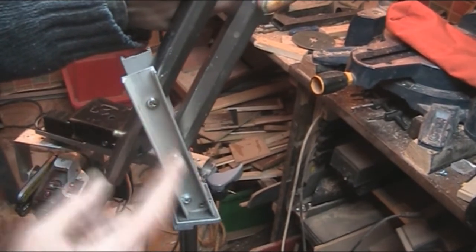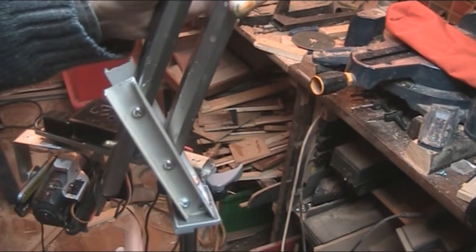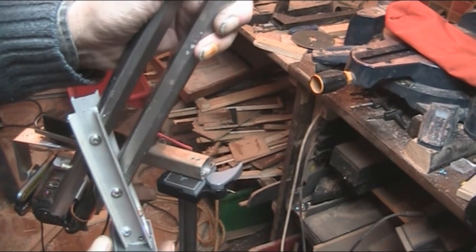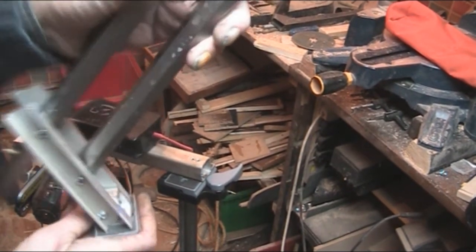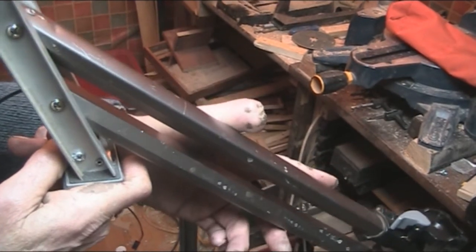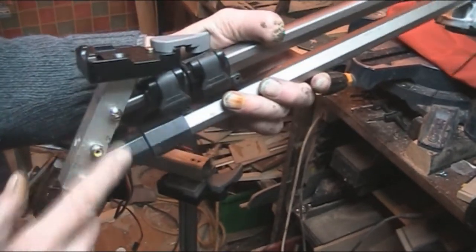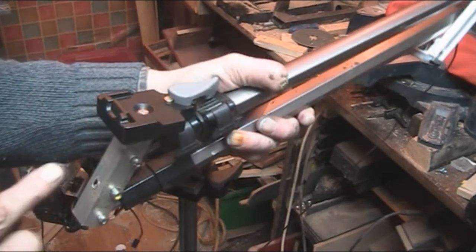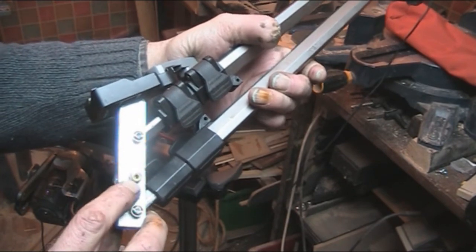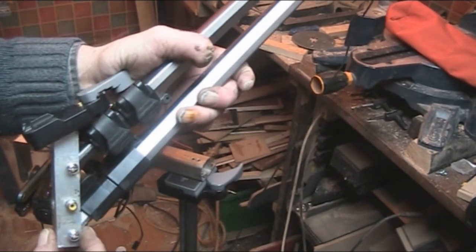This bar here I've changed - I've made it on an angle compared to flat. I should have done this in the first place because it allows more room to swing up. If this back bar can come almost straight down, you can get the boom almost straight out and get quite a lot of height, and it doesn't restrict the angle you can go down towards the ground. The front bar needs the same angle accordingly. I've also changed this piece for a U-shaped channel instead of the square with cutouts, and I've put an RCA socket on the side so I can plug the camera in and use different cameras with different adapters, like a DSLR.